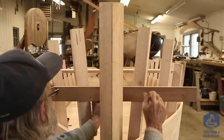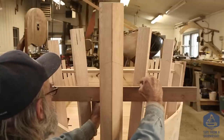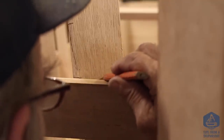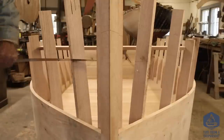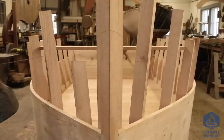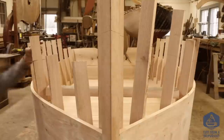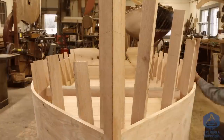The other thing about this is that I'm not going to cut these two frames off 90 degrees to the frames like the rest. I'm going to cut them off flat straight across because I want the breast hook to sit right up on top of it. Now I'm going to just kind of sight this because there's really no way to make this mark perfectly accurate. I've got an eight-point handsaw here and I'm going to cut that very forward frame off on the line that we had put on there. Now I'm going to move on to the second frame - that one's cut a little bit differently, 90 degrees to the frame itself but rising up along with the shear line. We're going to cut all the rest of them off just like that right down the starboard side and back up the port side.